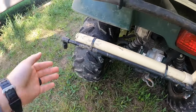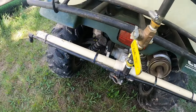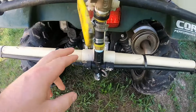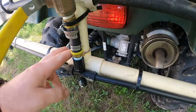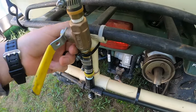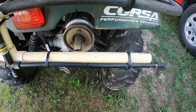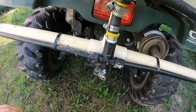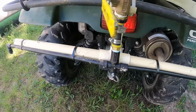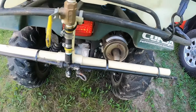dripping in my field. And again, this little boom sprayer I got on Amazon probably 4 years ago now, and it's probably a little outdated, but all we did was take a little 1-inch PVC and a little T-connection joint with another little piece of 1-inch PVC and another T-connection joint that we cut in half, and we just zip tied around the bar, and then we zip tied the boom sprayer to the 1-inch PVC, and it works really good. It's very stout. You just get it at the angle you want it at, and it stays there. And it's a really quick, easy fix to put on the four-wheeler to maintain your clover plots.